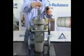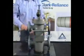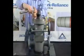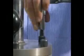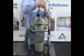Begin by loosening the T-handle and moving the ball handle to the neutral position. This breaks the shoe assembly seal. Next, remove the cap screws from the bottom of the assembly. Be sure to always break the shoe seal before removing the cap screws to ensure proper removal of the stack assembly.